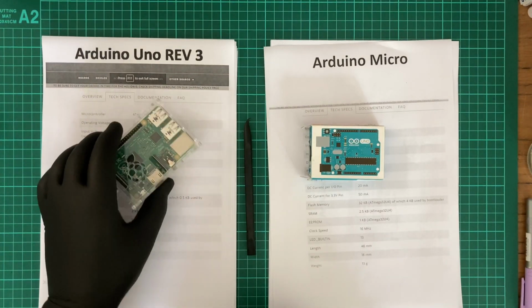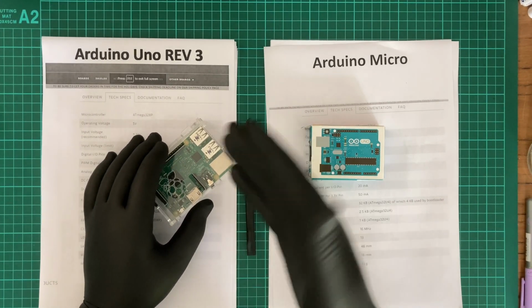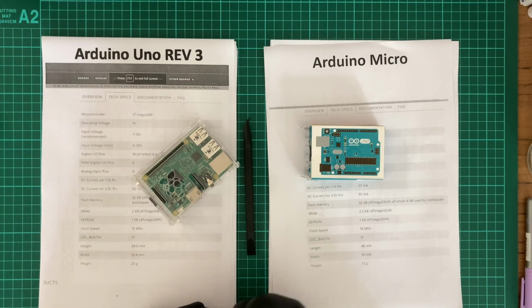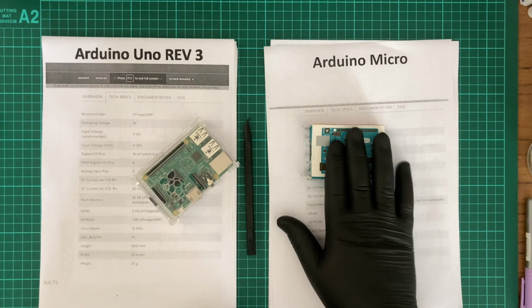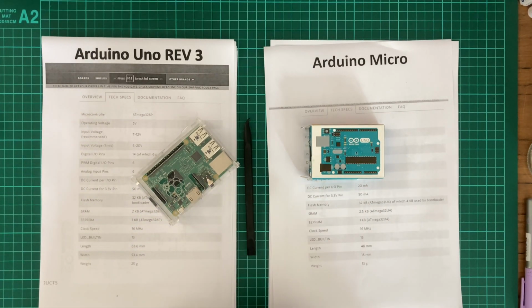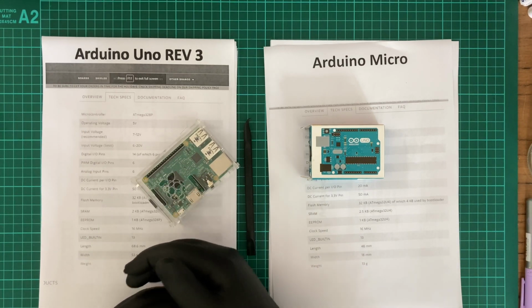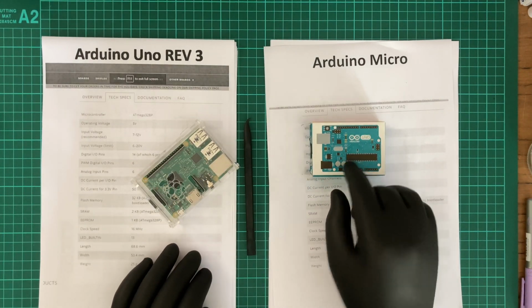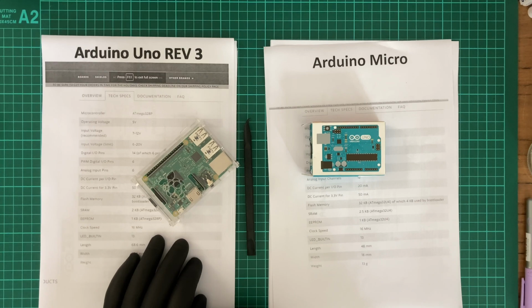Well, most of them. Now, both do have these pins, and that allows you to program it to do certain things. So say if a sensor is tripped, it can report back on here, it can send an email off, it could trigger something else to operate, or, you know, whatever. Arduinos can do the same thing, but they don't have all that junk. So, an example: if this thing shuts down, the operating system has to boot up, and then if it's been set up properly, it can start loading up all the sensors and everything to work. Whereas with this one, it just snaps. A few moments, it's back up and working.